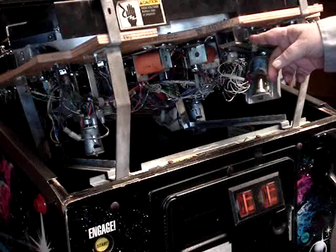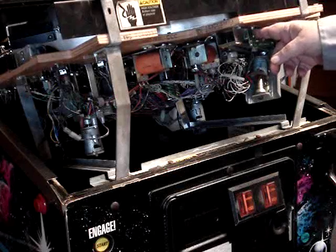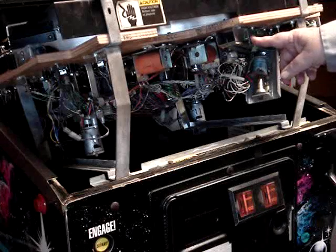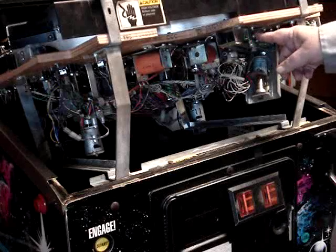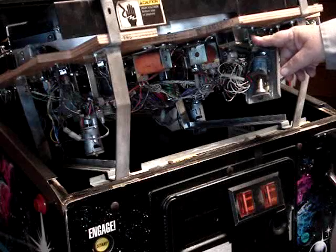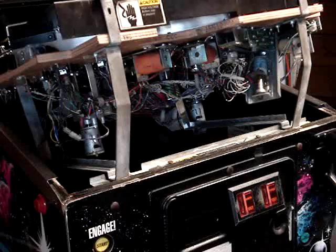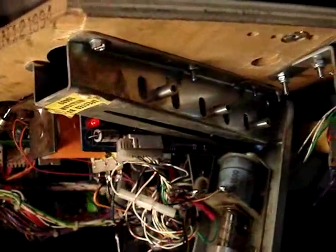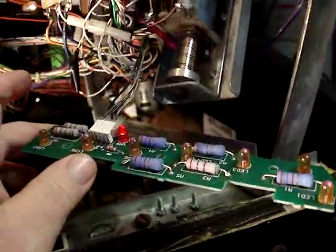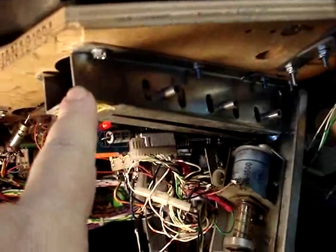We're going to take the board off. Using a camera, you can't see the infrared light with the naked eye, but most video cameras or digital cameras can actually see the infrared LED lit up. So that's the next thing we're going to do.